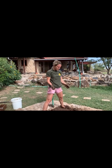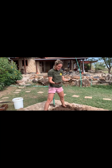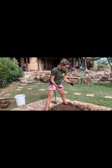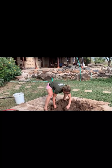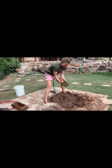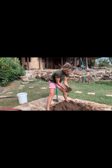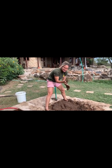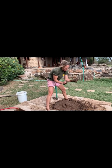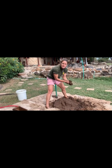Once you've got the consistency of the mix, which is a nice mix of obviously the mud and the sand, the idea is to use this sort of flat part of your hands, because obviously there's thorns and various things, and just scrape the mud together in order to try and get a consistent sort of feel to it. We obviously want minimal air trapped in the actual brick. So now once we've got it to this sort of nice consistency where you almost squeeze it and it almost keeps size but still has a fair amount of liquid, that's when we go into the brick making procedure.